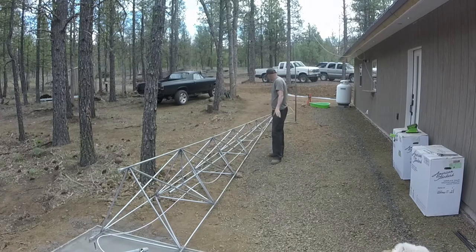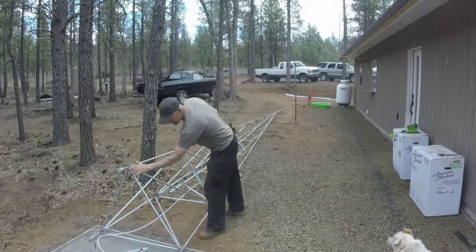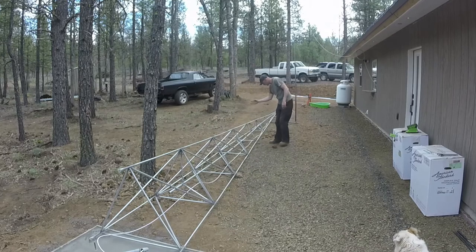But what I did for the calculations, the tops are welded together. It's got a little piece of conduit, a 1-inch coupler for conduit in the top that the 3/4 inch goes through. Other than that, the top is welded together. The bottom has a 3-foot piece. Each side is 3 feet right here. So to get the next measurement, I went halfway. Halfway is right here. Well, if you have a 3-foot bar down there and nothing up there, this is going to be 1.5 feet because it's halfway.